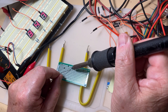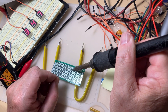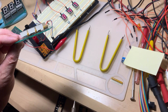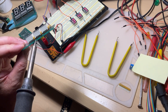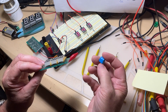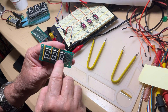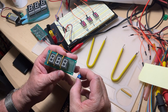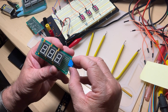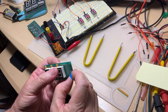I'm going to solder one terminal of each just to make sure they stay in place — one here, one here, and one here. I check on the other side to make sure. Take a look: they are at the same level but higher than the printed board. Then, by taking the terminal block — this was the position with the decimal points at the bottom — you are going to be able to mount it right here in the center.